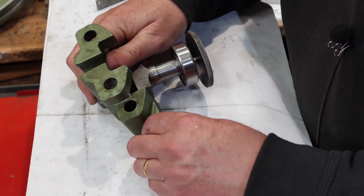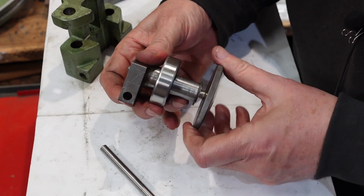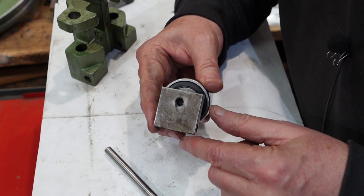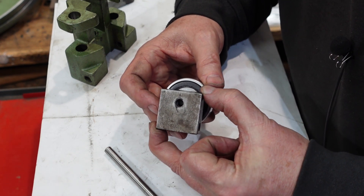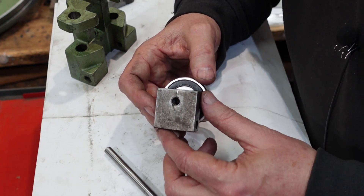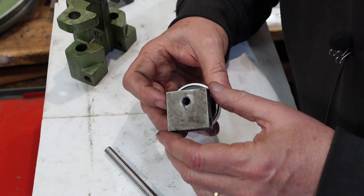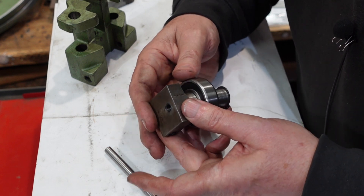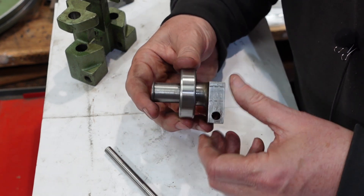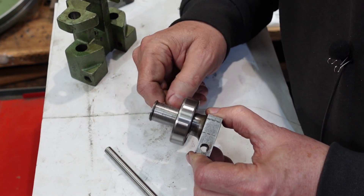This part just pivots on a pin — it's not something you're adjusting all the time, maybe every time you put on a new blade. The stock is roughly inch and a half square, about 38-something millimeters, which comes out of a piece of round bar at 55mm. I don't have any square stock of that size so I'm going to get a piece of round bar and take it down. I was given a length but it's slightly too small and I don't want to risk missing some corners that might be critical. So I'm going to use some 60mm stock, machine it down to square, then mount it in a four-jaw chuck, kick it over eccentric, and machine the diameter in.